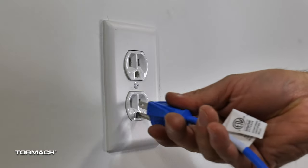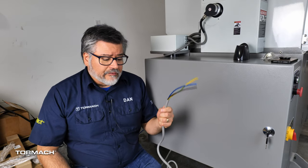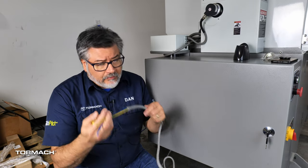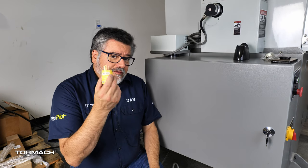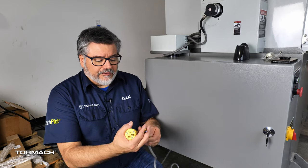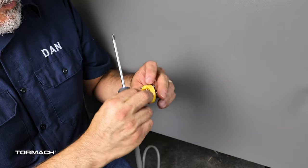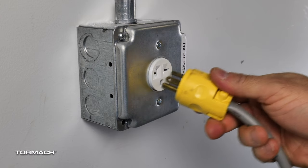Plug in the 120-volt power cord into the wall outlet. To install the 220 service, you have the option of either wiring it directly to an electrical panel with an electrician, or purchasing a NEMA L6-20 plug and connecting it directly to the wires. Cut the cable to length, then use the brown and blue wires to connect to either end and the ground. Reassemble the plug and connect it to the wall outlet.